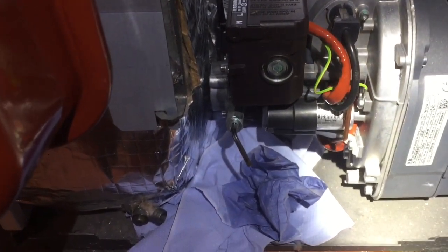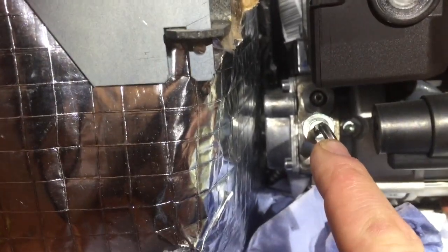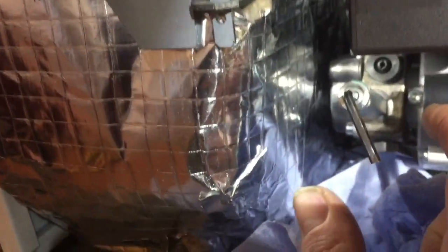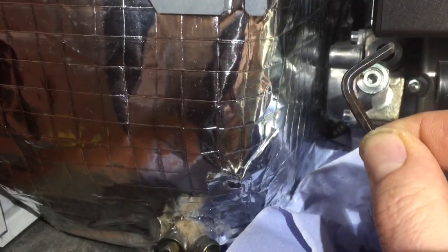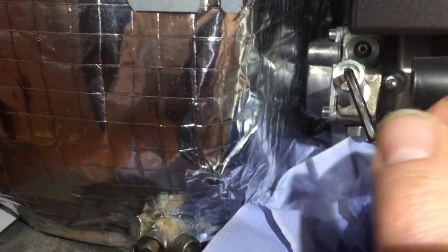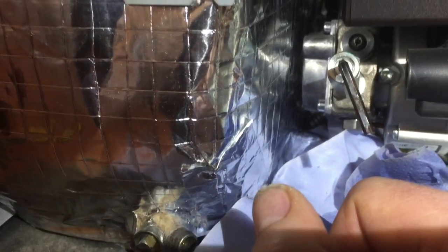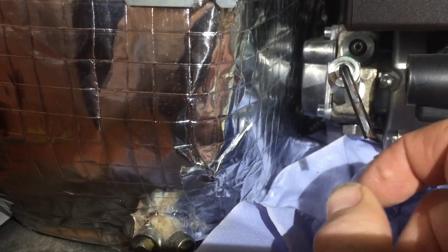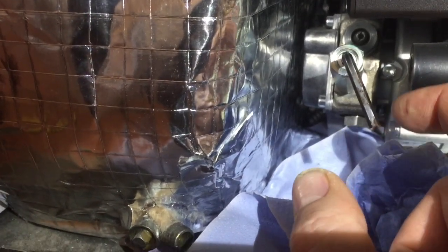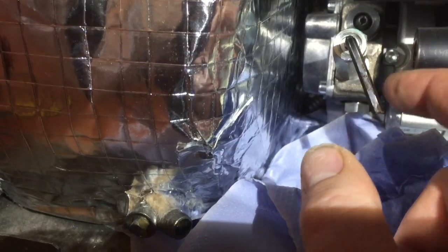The trouble is you've got air in your oil system. See where my finger is — there's a little allen key socket with a long extension on it. Put the allen key in there and turn it anti-clockwise a couple of turns and the air will bubble out. Leave it until the air bubbles out and it runs clear with no bubbles — this won't take long, a minute perhaps. Then tighten it back up.